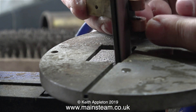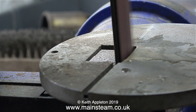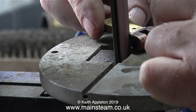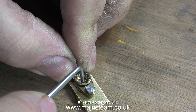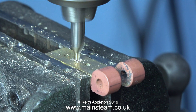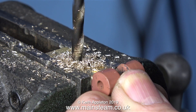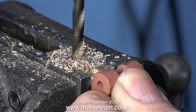Now it's time to profile the part using the belt sander. In this clip I'm working on the area where the new piece meets the old piece. Once I clean and polish up this part the joint should be invisible. I've already checked that the holes are in the right place so the rest of this is plain sailing. I put a couple of bolts through the original exhaust flange and now using a scriber I'm marking the position to drill a larger hole in the centre for the steam inlet. After accurately centre drilling the part right in the middle of the scribe circle, I'm drilling all the way through using a 7/32 of an inch twist drill.